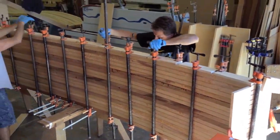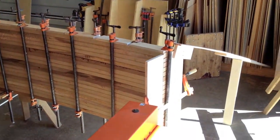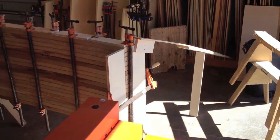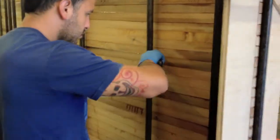As you can see, there are plenty of clamps. We leveled the horses real nice and then clamped pieces of plywood at the end to straighten it out and braced it off to whatever we could in the shop to take any twist out of the wall. Each end of the wall is plumb and it's sitting on level ponies.